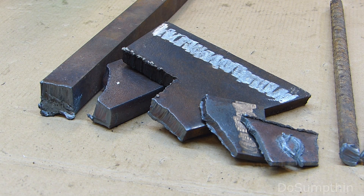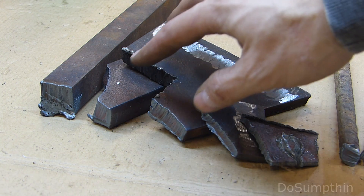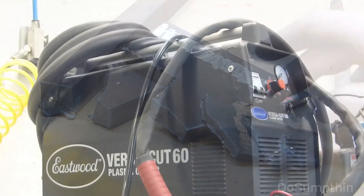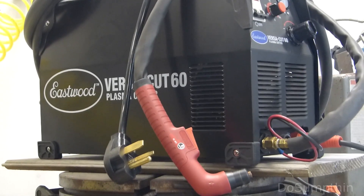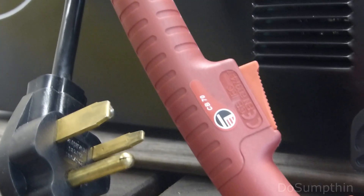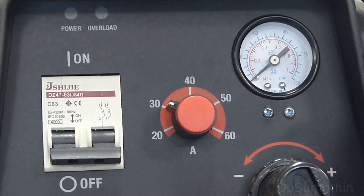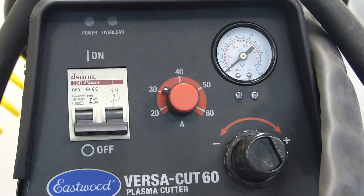The conclusion: overall I have to say I'm pretty darn happy. Yes, there is some slag on the cuts, but I can't really expect much difference given I don't have much experience other than what you just saw. I did a little research and understand that slag can be worse if the plasma cutter is set too high, if you're cutting too slow, or due to air pressure — lots of different things can affect it. So I really look forward to spending more time with this tool and learning how to use it in the most efficient manner.